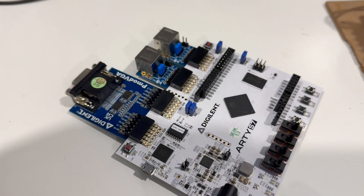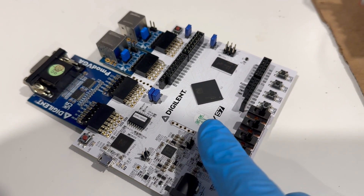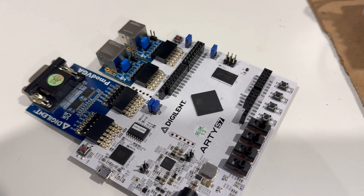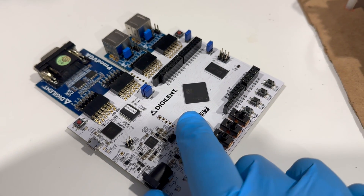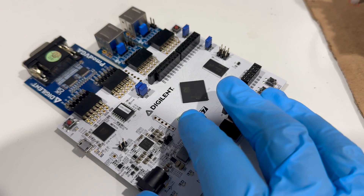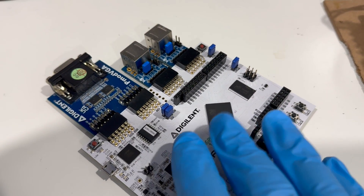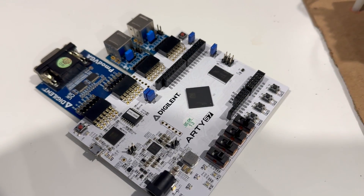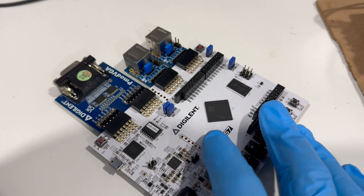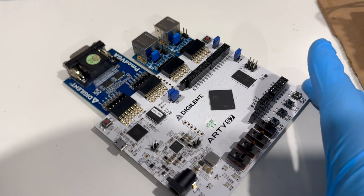The second thing is I was thinking maybe to move from S50 to S100, only because of the IO limitations. S100 can go up to 400 IO pins, which will be required for all the peripherals I need for AmiCube: the CPU slot, two floppy headers, IDE header. I also want to have HDMI plus Ethernet and all that good stuff.